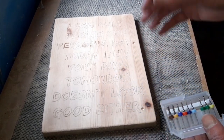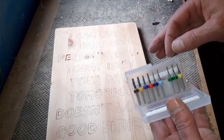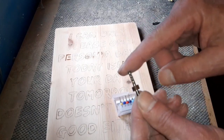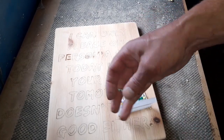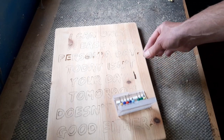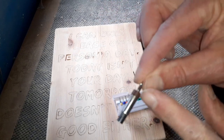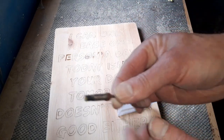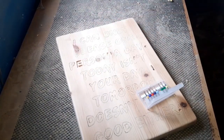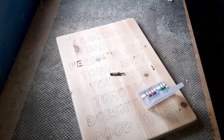There are different bits out there — spiral up cuts or down cuts — just find one that suits you, but for me little end milling bits are fine. We can afford to go with a nice large one so I'm going to go in with the biggest one. We've taken our CNC bit out, we slot the end milling bit up to that little barrier, pop that in the router, then sit it on top of the letter to set the depth — or use the little depth gauge from earlier. Let's get this set up and start clearing this one out.